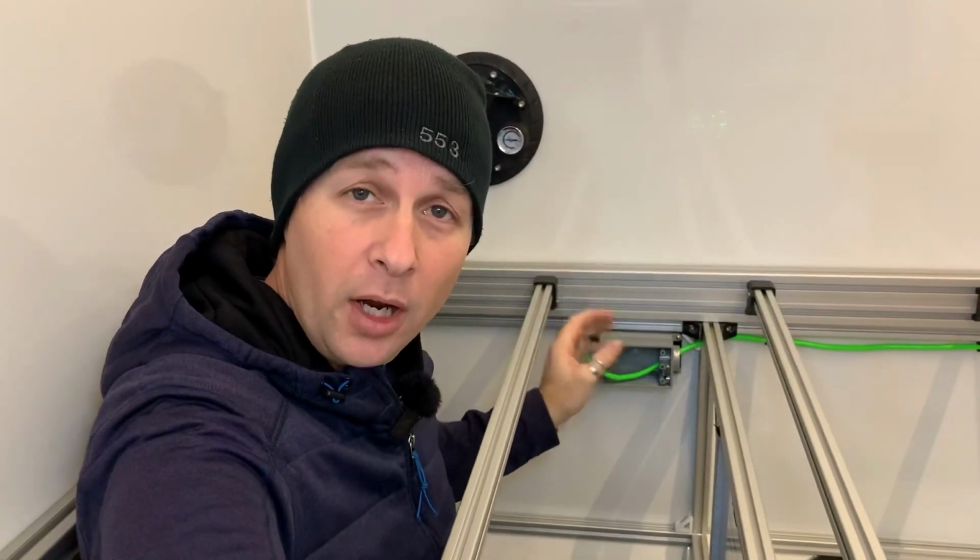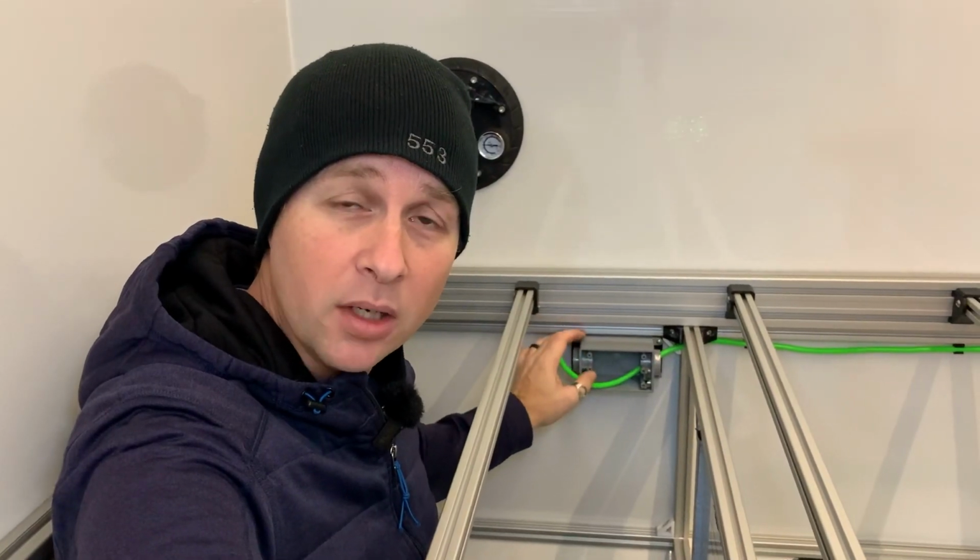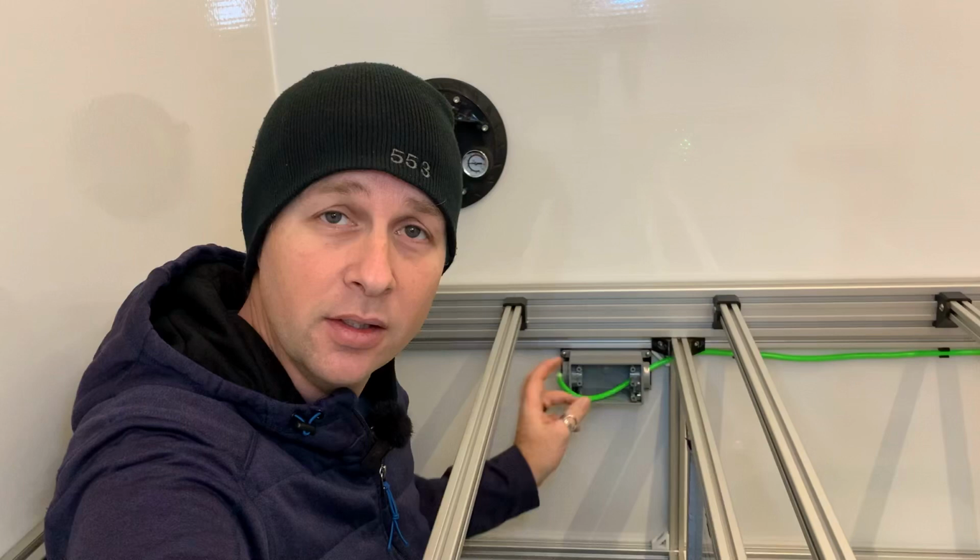Recently, you'll remember I ran the wire and installed the boxes for the 120 volt outlets, and I talked about using stranded instead of solid wire. There is one thing that you do need to take into account when we're doing this, and that is that standard 120 volt household outlets are not really designed for stranded wire.